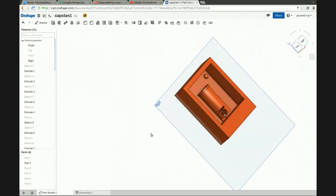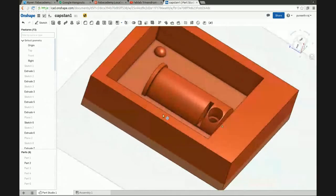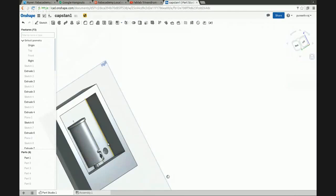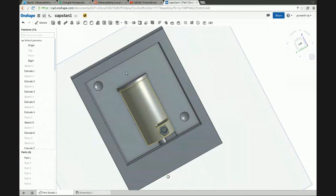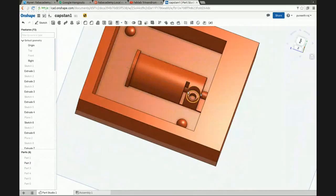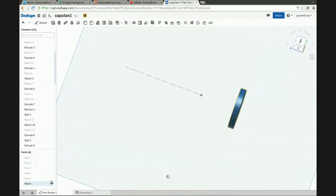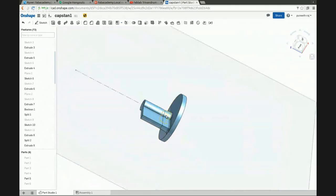Can you do a close-up of this? So this is one of the molds, and this is another part of the mold. I want to make a hard plastic part out of this. I'll pour silicone here, making this the positive, and get the negative silicone mold. Here also I'll pour silicone, get the silicone mold, and after that I'll do this part. This peg will go inside and then create the whole feature.